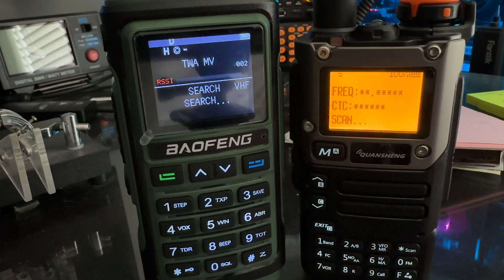Now here I have a portable radio on the bear's head frequency on talk-around. The talk-around frequency is 146.895 with a DCS of 131. Let me key this radio up and let's see what these two radios find with the frequency counter.